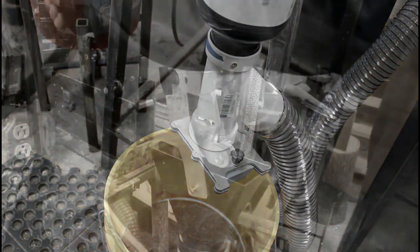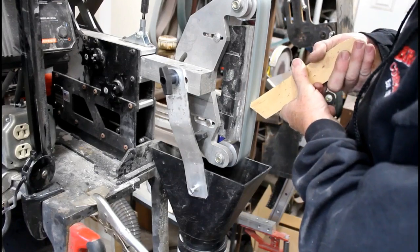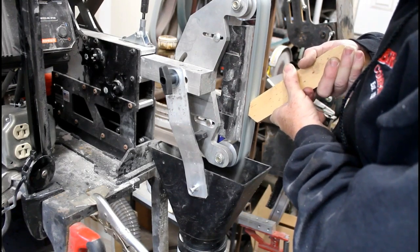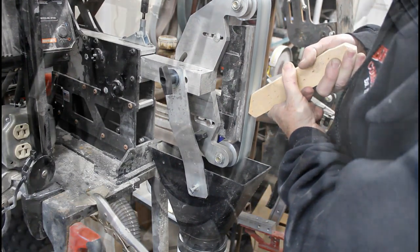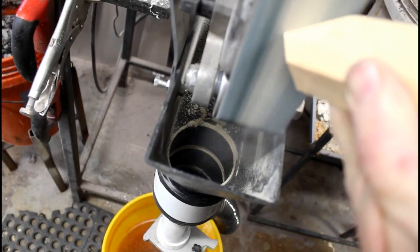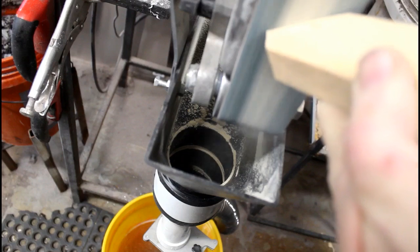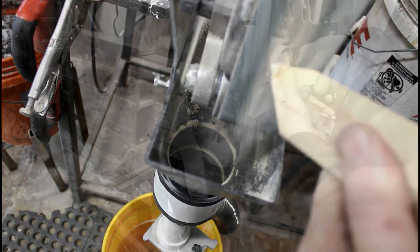I'm going to close the blast gate — this is an aluminum blast gate, they cost between $14 and $20 and you can find them on Amazon; just search for 'dust collection system blast gate' or 'aluminum blast gate.' When grinding wood for knife handles, micarta, or fiberglass, the majority of that dust really does get sucked right into this dust collection system. The wet/dry vac had enough pull to work really, really well. I can improve that in the future, but for now this is a great improvement over what I had, which was basically nothing.